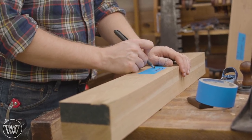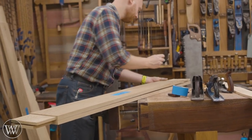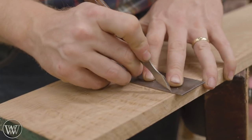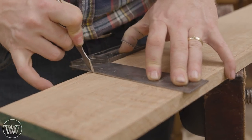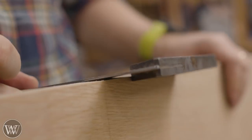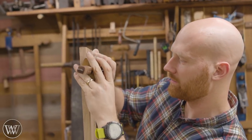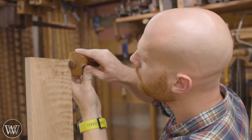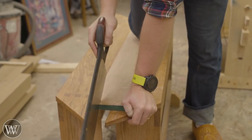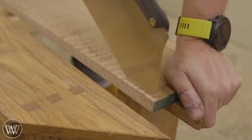Make sure you label every leg so that you know which one goes where - there's nothing worse than drilling the hole in the wrong place. Speaking of which, let's start working on the tenons between the stretchers that go between the legs. These are fairly large tenons, about 5 inches by about 4.5 inches long, a half inch wide. First thing I want to do is mark out where the shoulder of the tenon will be all the way around the board. The shoulder is the important thing, not the length of the tenon, because these are through tenons and they will stick out the end - I'm going to leave them all long. On one side I'm going to cut it at a one inch mark, on the other side a quarter inch, and this will alleviate some space so that when the tenon goes through the leg at the top it doesn't leave the top of the leg weak.